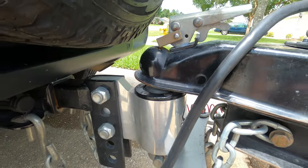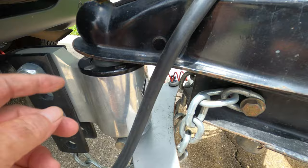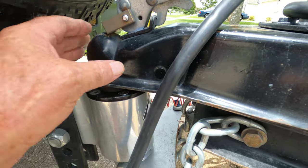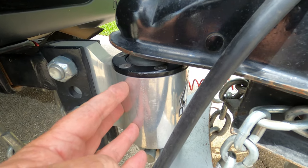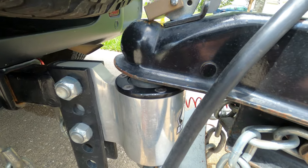When the plate turns, the actual ball turns inside that aluminum housing, so the ball never turns up in the top of the hitch — and that's how they use it to reduce sway. There's a teflon sleeve inside this piece right here, and that reduces the swaying of the trailer.